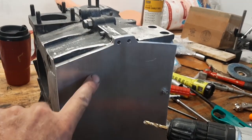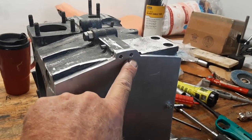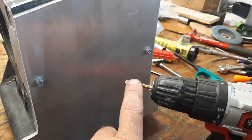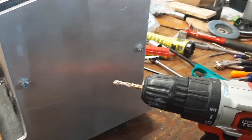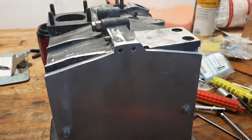By using the new plate as a drill guide — because I drilled these holes with the drill press so they're nice and straight — you can use a hand drill with a short stubby drill bit and get a nice, straight hole into it without much effort.